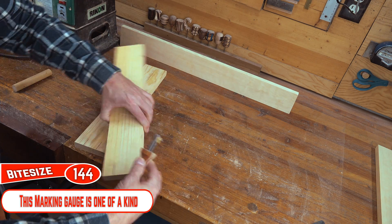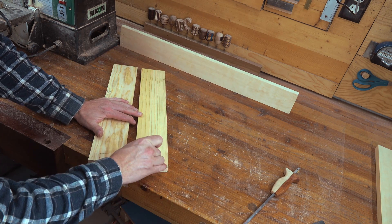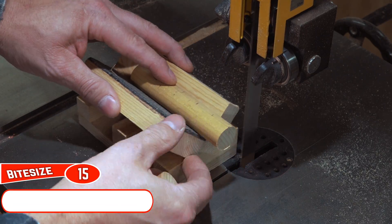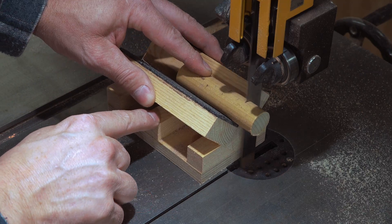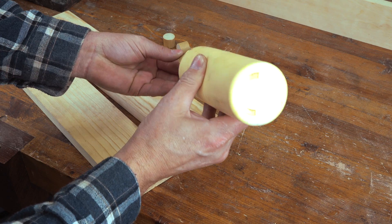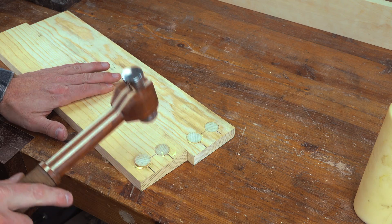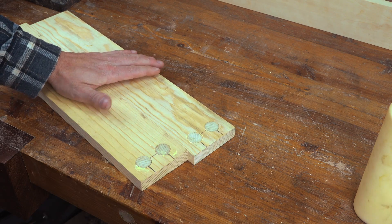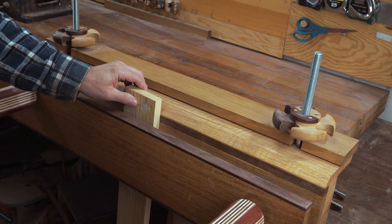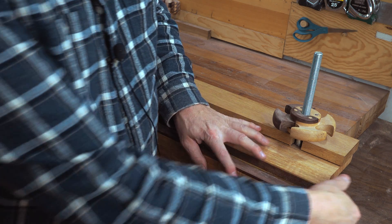I'm going to mark over an inch from both sides and then mark an inch from the bottom. I'll use an awl on those marks and drill each one out with a 7/8 drill bit. I'll cut four dowels that will fit inside those holes. I'm going to add a little bit of glue — you really don't have to, I don't think it matters that much. I'm going to use a quad vise to attach this together, though you obviously don't need one.